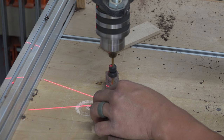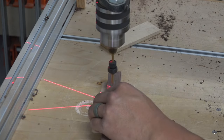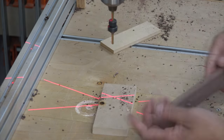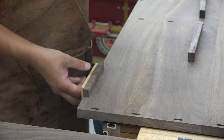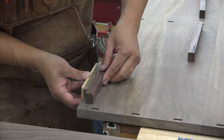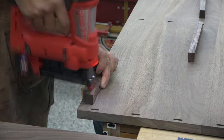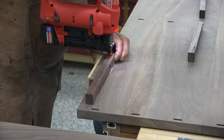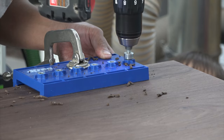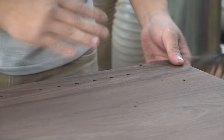I made the cabinet back removable. It is attached to the sideboard using screws through rectangular cleats that are nailed and glued to the top and bottom of the sideboard. After I pre-drilled the cleats I used a spacer block the thickness of the cabinet back to set the cleats. Some quick-set wood glue and pin nails help secure them. While I had everything laid out on the assembly table I also drilled shelf pin holes in each of the cabinet compartments.